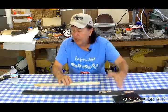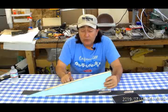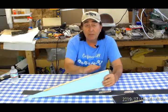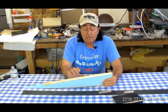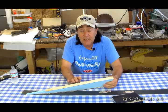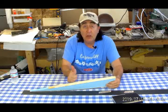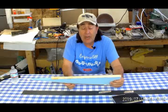There's a section of the wing that has the flap, and on the flap there are no spar caps because it's going to have a sandwich panel skin on it — fiberglass and some other composite materials. The ribs there are just formers for the skins, and the skins are structural in that they can carry the loads up and down and fore and aft due to activation and usage of the flaps.